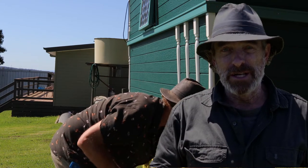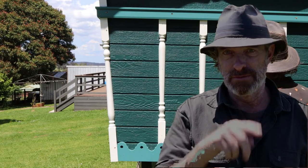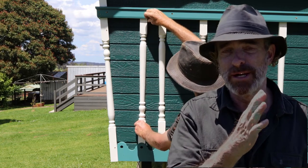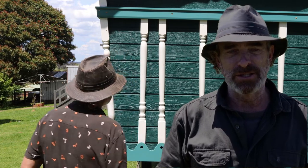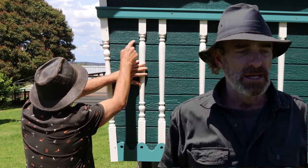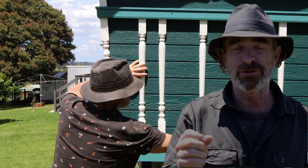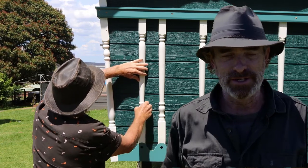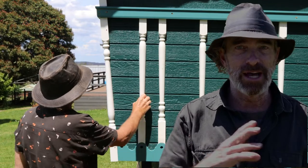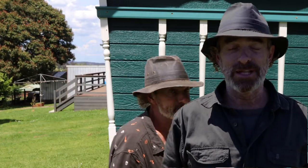The other thing that became very obvious to me was that back wall. I should have started each of those balustrades one curve of the trim back towards the corner, because when I stood back and looked at them up the top, the gap was just too wide. So I went to the trouble of pulling them all off. They were all good length, so I could just shift them all across by one. But of course I had to clean off the liquid nails that I'd used to put them on and do a couple of heavy coats of paint to cover up those obvious marks. But that solved all that problem.